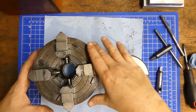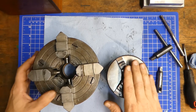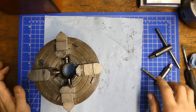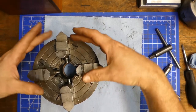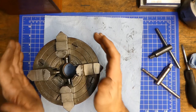There are other combinations: six-jaw chucks that are typically self-centering are probably the next most common after the three and four-jaw. Ox Tools uses one occasionally. There are chucks with larger numbers of jaws, though those are usually on much larger machines — you run into a physical space problem when you try to put more and more jaws into the same space.